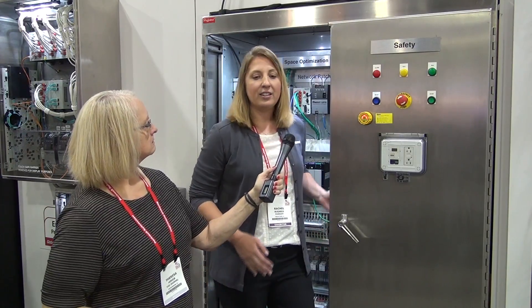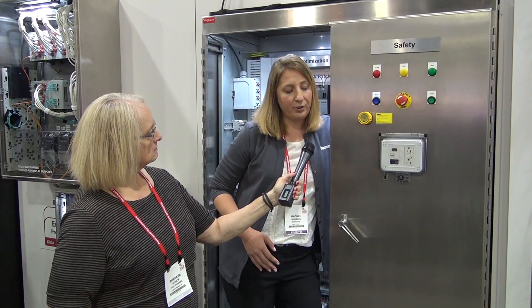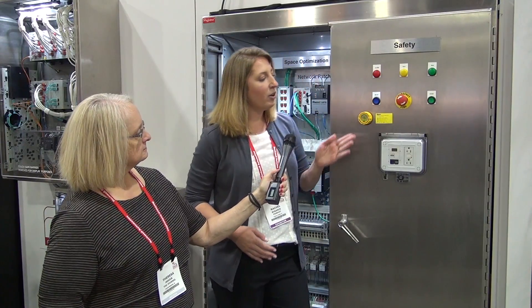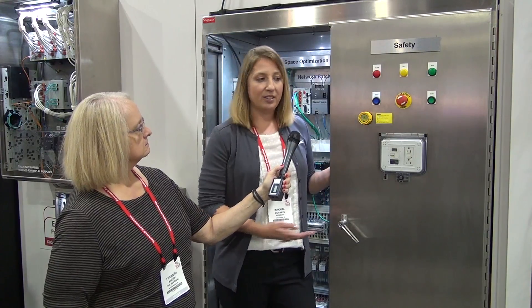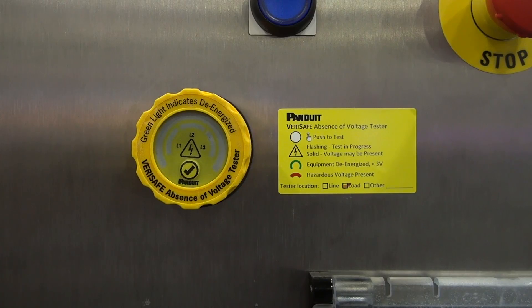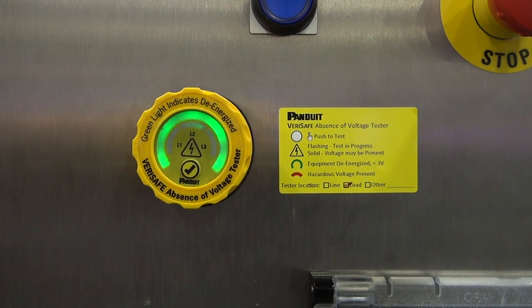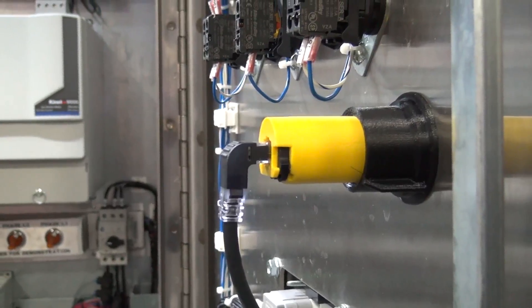What's really unique about this product is the absence of voltage test capability. So I'm going to shut off power in the panel. And now, if you were to come up to this panel, you wouldn't know whether or not it is de-energized. So we've incorporated a push-to-test feature. The device is going to go through a series of steps and then give visual indication with the screen light to verify the absence of voltage.